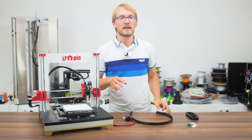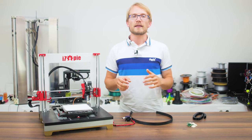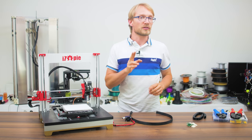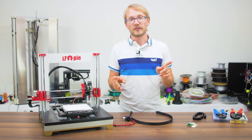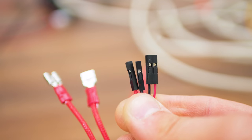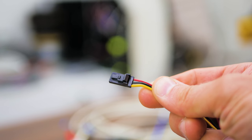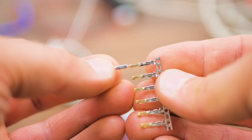Connectors are easy to overlook. If your cables already have connectors on them, you're good to go, but it's not too hard to add your own. I've personally settled on two types of connectors that are compatible with what's typically used on controller boards and easy to crimp yourself. The first type are Dupont connectors — one-tenth of an inch or 2.54mm connectors crimped onto the wires. They don't have any keying, so they'll pretty much universally fit on any other tenth-of-an-inch connector, whether it's wide types used for computer fans or more complex locking types seen on some boards. You can use male and female pins to easily craft extensions or disconnect points.